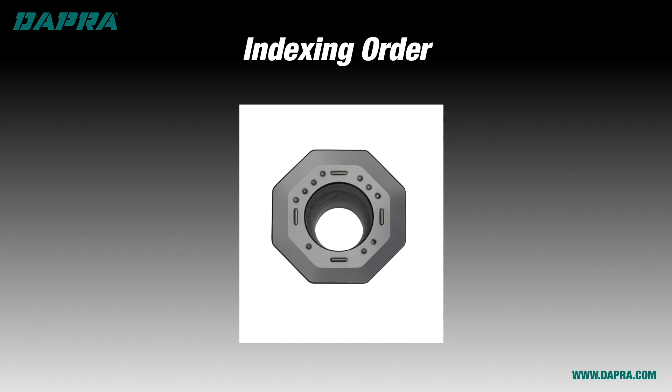An important issue to note is that whenever the surface finish matters of the feature you're machining, be sure to index all of the inserts in your cutter body to the same cutting edge. In this photo of a typical octagonal insert, notice the edges are marked with corresponding dots. The marking style doesn't really matter and could be numbers, dashes, or symbols — what's important is that the same edge is in use on each insert in the cutter. This provides the best accuracy, meaning the least runout, and will create the best surface finish. An additional benefit is that each insert will be doing an equal amount of work, so tool life is both equalized and maximized.